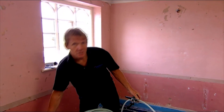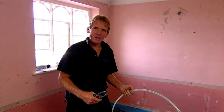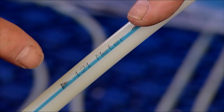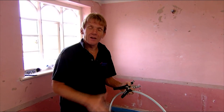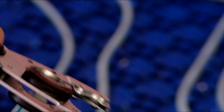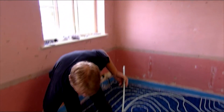On the pipe it's printed — this is a 200 metre coil, so we've started using it from the 200 metre mark which is the outside edge. We find that the printed edge now shows 121 metres left, so if we had another circuit to do we could calculate that this coil was enough. So I cut myself off a nice margin to get through the wall and up to the manifold — simple job — and lay that coil aside for my next job.